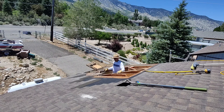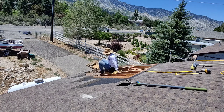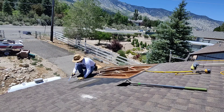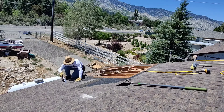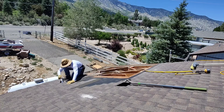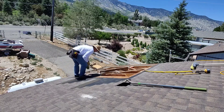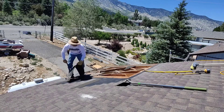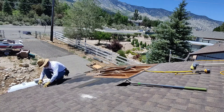Luckily I have a driveway right next to my house so I can throw everything just from the roof. Now you can see the 2x4 structure that they had framed into the roof there. For a masonry chimney you also have to have certain clearances for fire risk prevention. You keep seeing me with a flat bar to poke under those shingles to get the nails loose, and I always make an effort to remove all the nails as well — I don't want to have anything stuck under there.